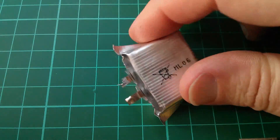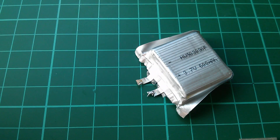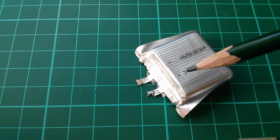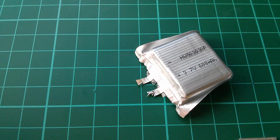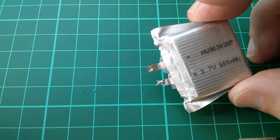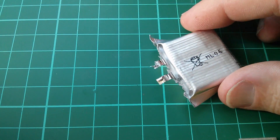Now that's got the battery down to its bare LiPo pack. Fortunately it has plus and minus marked on here, so I know that this is the positive. It didn't take solder terribly well, so I had to get it quite hot to do that, and of course that's a little bit worrying when you're soldering so close to the chemistry, but that's done.